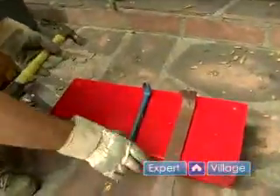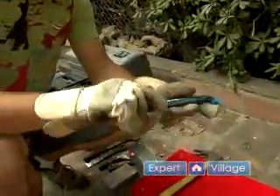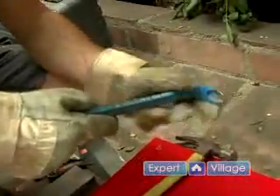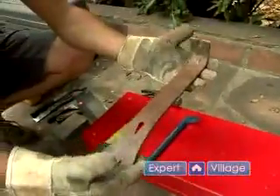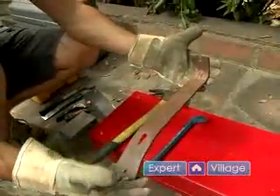You're going to need a good heavy hammer. This tool right here is called a cat's paw, and what it does is these teeth dig into the wood to get underneath nail heads that otherwise you wouldn't be able to get to. And this is your average flat bar. These are all very cheap tools that you can get at any home improvement store.